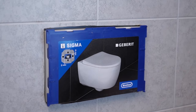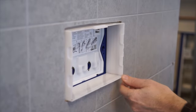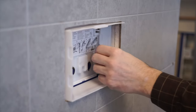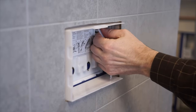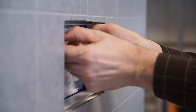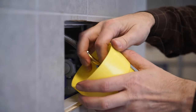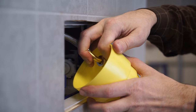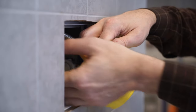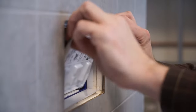With the bowl installed, it's time to install the actuator. Remove the face cap from the mud guard. Using a utility knife, cut the inside of the mud guard at the four corners, making sure to cut all the way through the plastic, then bend and break away the four mud guard panels. Ensure the panels do not extend past the finished wall. Remove the splash guard and the flush actuator gearbox. With the stop closed, disconnect the supply hose. Open the stop and flush the line for 30 seconds. Close the stop, reconnect the supply line, then open the stop and check for leaks. Replace the flush actuator gearbox and splash guard.